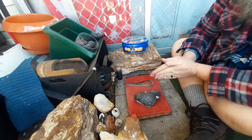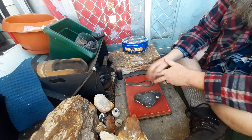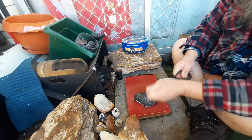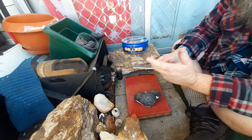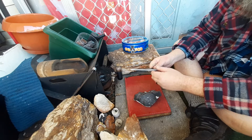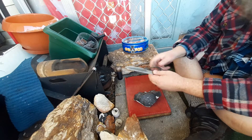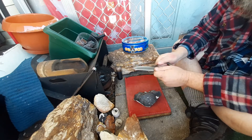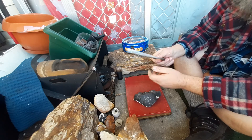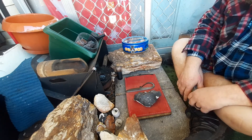For strikers, you can harden them a lot harder. This one wasn't tempered — I just oil quenched it. Probably isn't as hard as my normal strikers, but it certainly sparks as good as any of my water quenched ones.